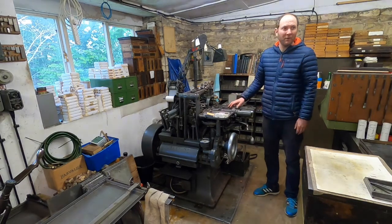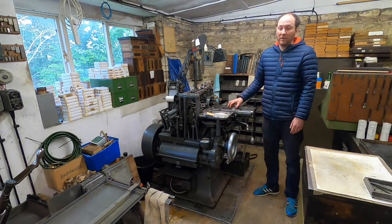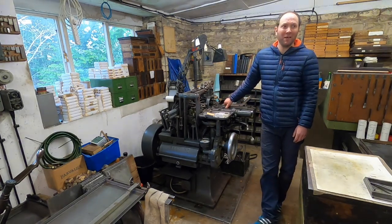These machines are so complicated because you've got running cold water going through the mould, which is there to cool the type down. As soon as that lead has hit the die case it has to solidify at just the right speed before the next pump comes along — you're casting at about three characters a second. So you've also got the balance of the air and the heat of the lead. It's a lot of things to have your eye on at one time, which is why there are very few people left in the country who can work these machines. We're very lucky to have them here.